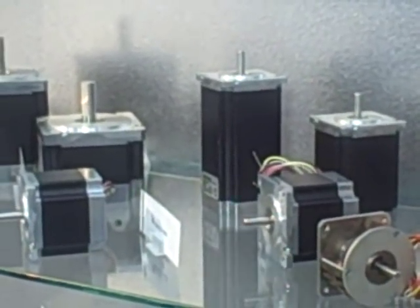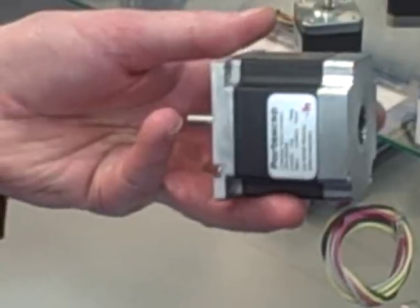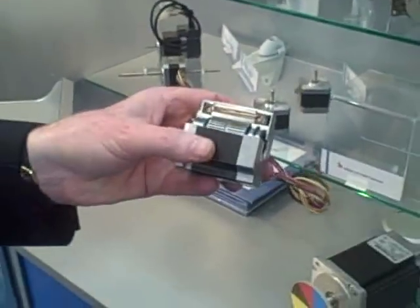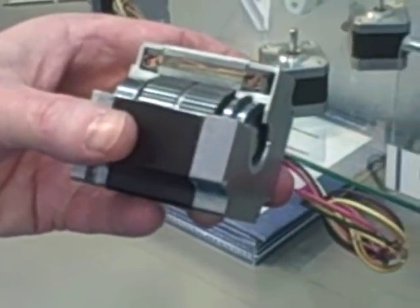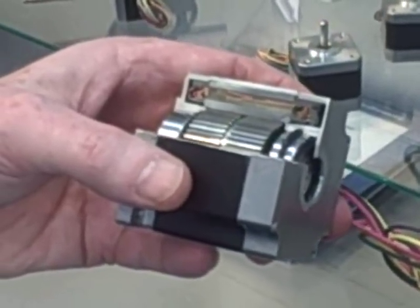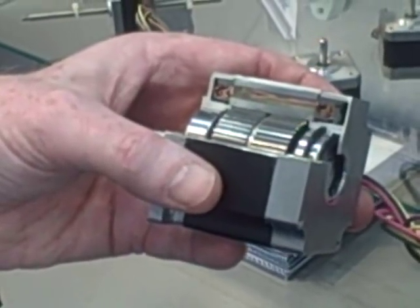In addition to that, it's housed because we use an Aluminium Tube. The Aluminium Tube covers the laminations, which are machined very accurately to provide — as you can see — a very, very narrow air gap that allows us to provide maximum flux to produce the most torque possible out of this frame size. We have several patents on this design.